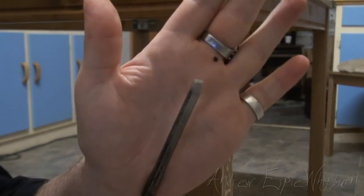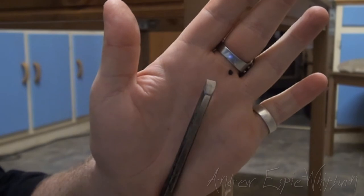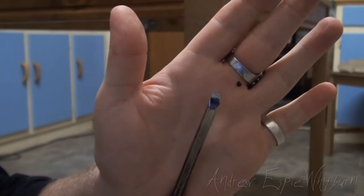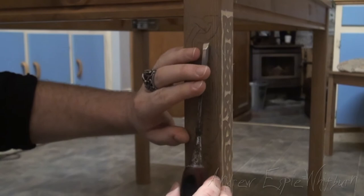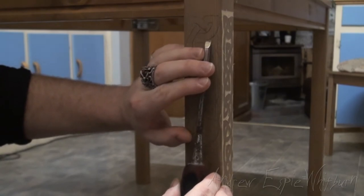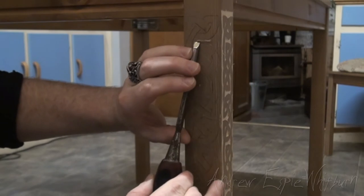When you're carving, you use gouges. I've just got a normal basic chisel here — just a normal bevel on it. You can see it's fairly sharp — almost a mirror finish — and it is very sharp. What I'm going to do is apply just gentle pressure. Especially when your tools are sharp and you're using soft wood, I'm just going to put a little bit in there and move towards the stop cut. You can hear it stop — hear that? Stopping.